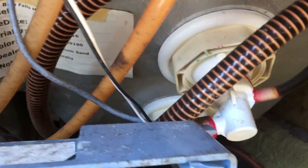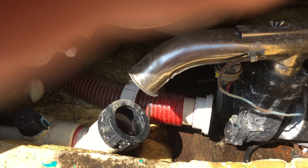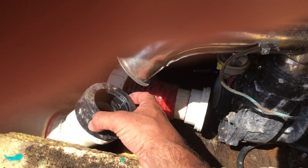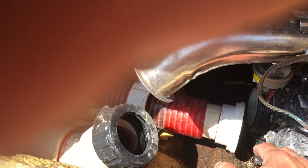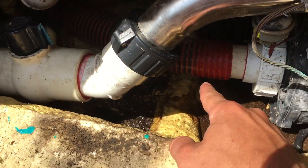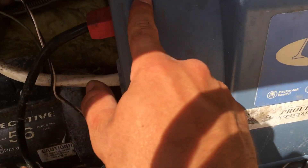As you can see here, all of our lines are looking pretty good. They're all attached to our pumps and filled with antifreeze. Now it's time to start connecting things. We're going to connect the valves to the pump — inlet, output — and make sure everything is nice and snug. Once all the lines both in and out are installed hand-tight, we're going to close up our electrical box with screws on four sides.